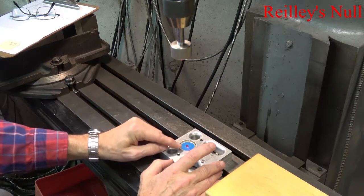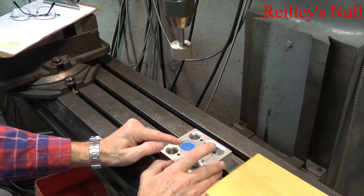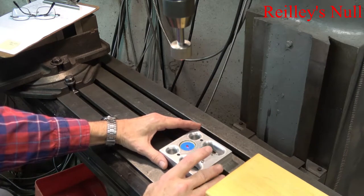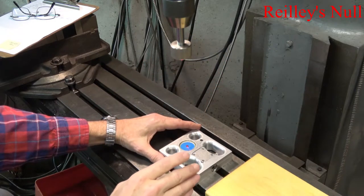The beam goes back up, back down — another dot — back up, back down — another dot — and it just runs off the mirror. That's an indication of misalignment between my table surface and the target mirror.